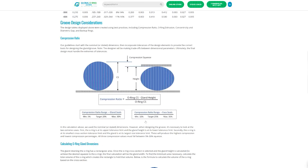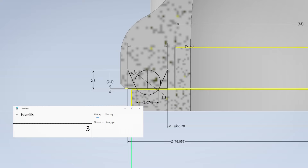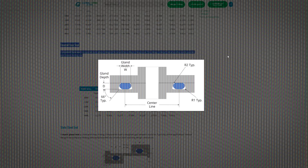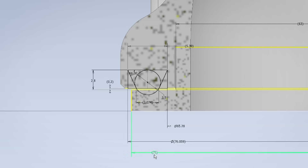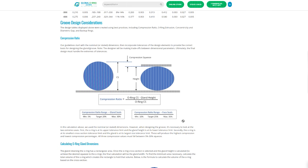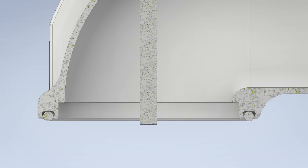There was a little back and forth to arrive at that number, but I found a local supplier who stocks a large range of ID options in a 3.5 millimeter wall thickness. If I apply a conservative stretch rate of 3% to the 64 millimeter option, that gives me something that looks pretty good. Next, I need to think about the squish of the seal. This seems to vary, but info that I've found suggests an ideal compression ratio of 25% — 75% of 3.5 gives 2.63. Some further examples for the dovetail shape, which I've decided to use to help retain the o-ring when the hat isn't installed or tightened, suggest a gland depth of about 2.7 millimeters and an angle of 66 degrees. This will allow for expansion when the gland is squished, and finally I'll add the suggested inner and outer radii of about 0.3mm and 0.8mm respectively. Remember, you asked me for extra information.